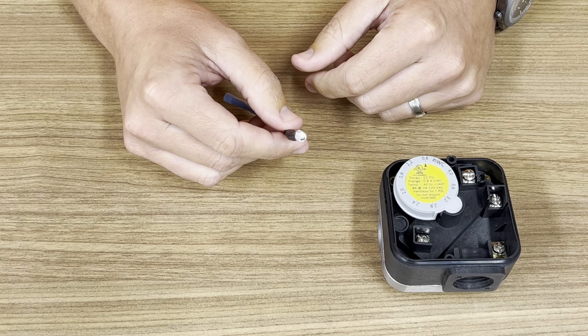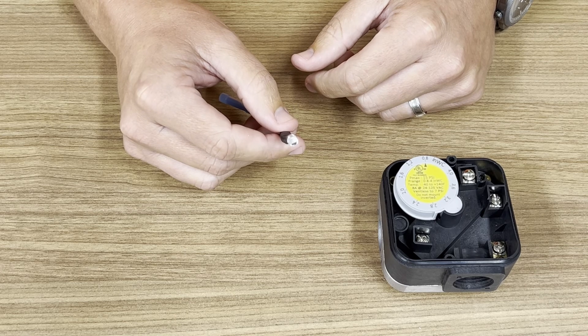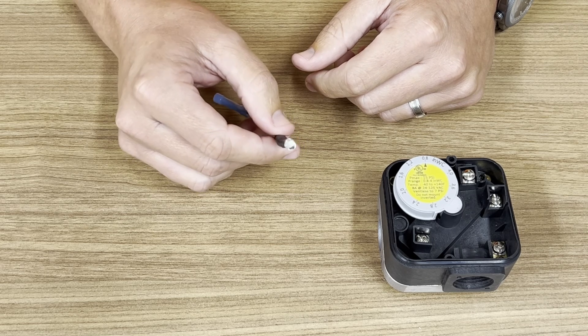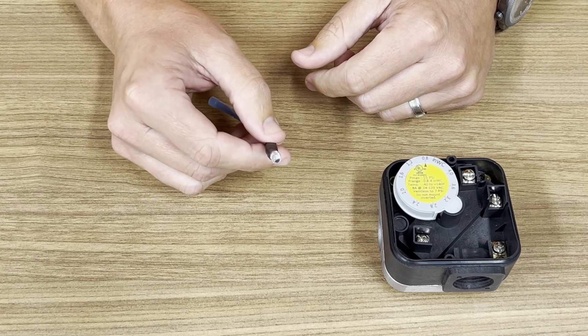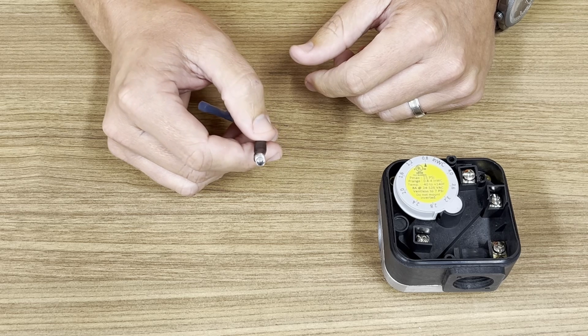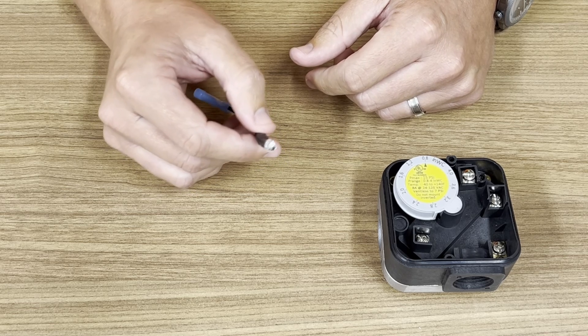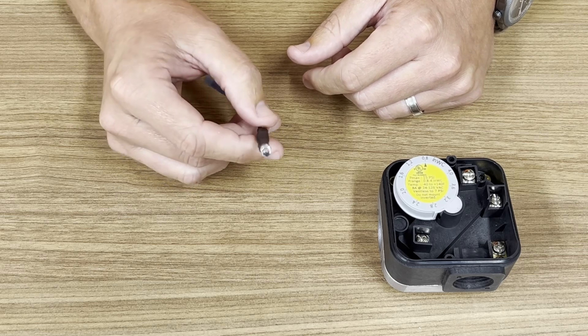Offered as an accessory are green and red LED lamp options for both 24 volt AC/DC or 120 volt AC line voltage. You can wire the green lamp to indicate good for operation or the red lamp for an alarm state. Between the two colors and the two voltages, there are four lamp options. Make sure to select the appropriate lamp — it is sold separately.